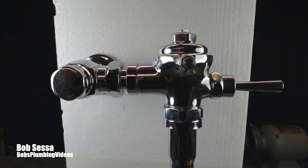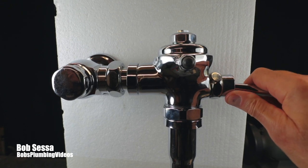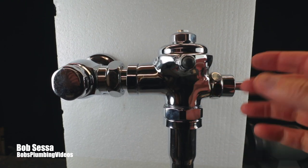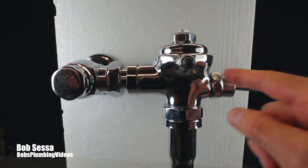As far as repairs go, superintendents do most of the maintenance work, but there are people who don't want anyone coming into their apartment and want to make their own repairs. The number one complaint I've gotten over the years working in multi-unit buildings was that the flushometer won't flush - you hit the handle and nothing happens, no matter what. They pull it up, push it back, pull it forward, and the flushometer will not flush. That's a function of the handle. I'm going to flip this over and show you the inside to give you a better understanding of why it doesn't flush and pull this handle out to show you the end of it.